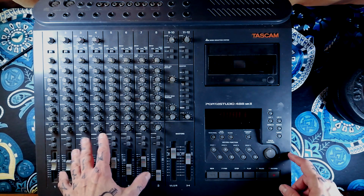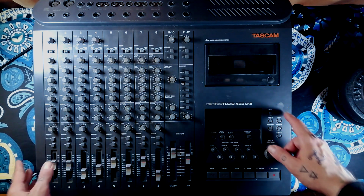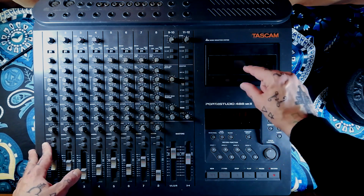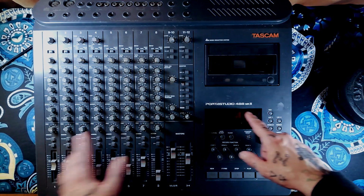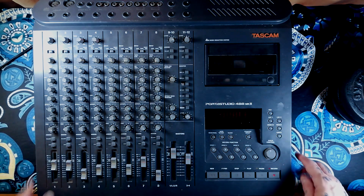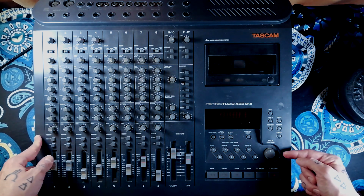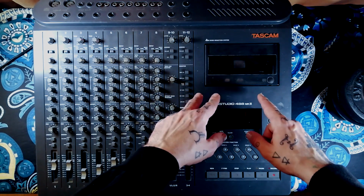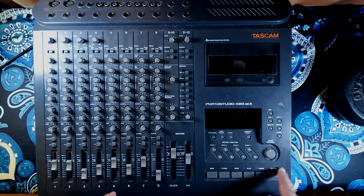In a previous video I went into quite a bit of detail changing gear C in a Tascam 464. Gear C is part of the cassette mechanism that raises and lowers the magnetic tape heads. I mentioned in passing that I'd read that the Portastudio 488 Mark II also had a gear C. I've never actually had my hands on one before, but I picked one up on eBay recently, and this is an opportunity to show you one of the symptoms that can give you a clear indication that the gear C is broken, which is that these three LEDs flash.